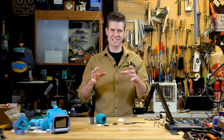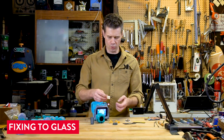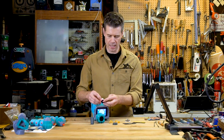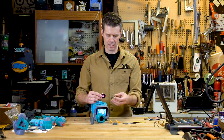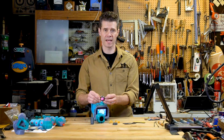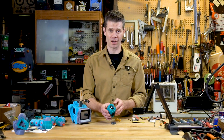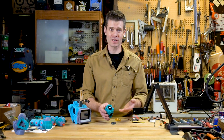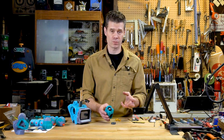Pathfinder has this really cool distinct single eye lens that glows. So what I'm going to do is actually use some black Sugru along the back of this LED to hold it to the white piece of acrylic. And then I'll be able to use Sugru to bond all of this and even attach this to the backside of the lens. This is one of these cases where Sugru is kind of perfect for the job because it sticks to glass, and there really isn't a lot of choice when you need to adhere something to glass and then also to plastic, as well as having something that conforms so nicely.